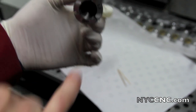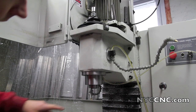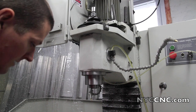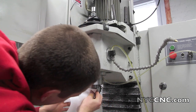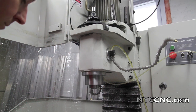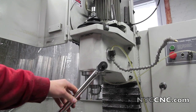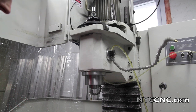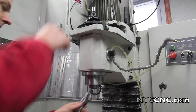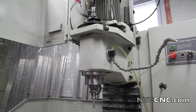I tried to make sure to get it in the tips, because if you look at the old collet, that was where it was actually really gripping — and unless you lap it down, inevitably you're going to have friction points right there. I put some in the inside of the threads too, being careful it doesn't drip down into the collet area. The R8 collet sticks out about an eighth of an inch below the spindle, so I'm wiping the Never-Seize off that part. I'll set the torque wrench to 30 pounds — the maximum you should need — put a TTS collet in first, hand tighten it so it doesn't fall out, then torque it down to 30 pounds and put the power drawbar back on.